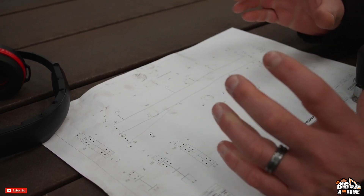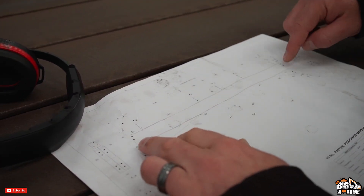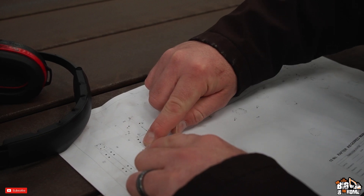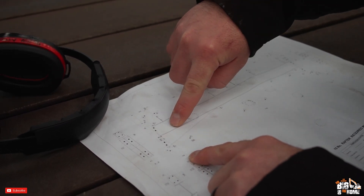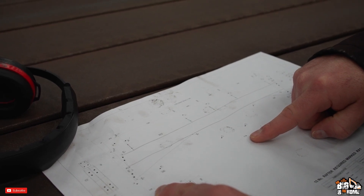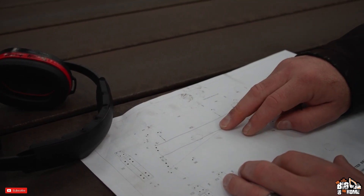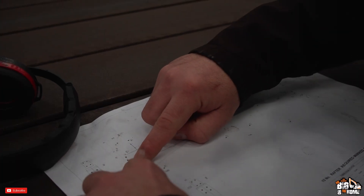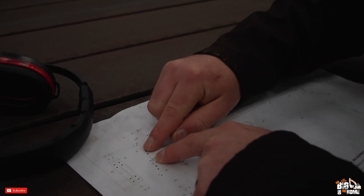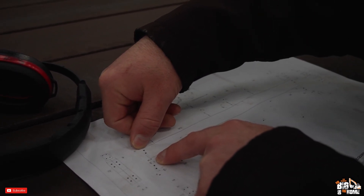Like the parts drawings, we've got every bit of information we could possibly need to fabricate this piece of steel. The first thing we start with is double-checking the length of the rafter — these have been checked before they come in but it's just another checking method. We check the long-to-long measurement, making sure the overall is 7,126mm. We also double-check the bevel measurement: from the longest edge to the shortest edge — the bevel as in the angle — that should be 81mm. We'll drop a big square on the underside to check and measure that.